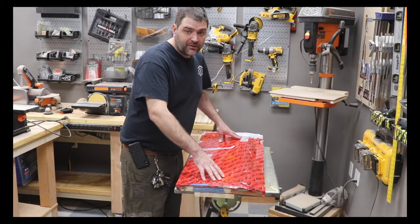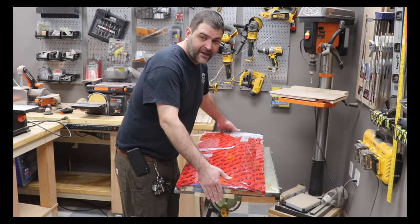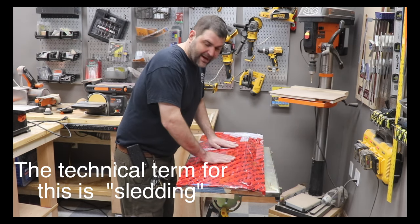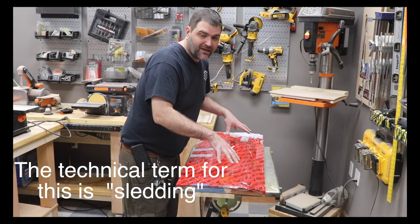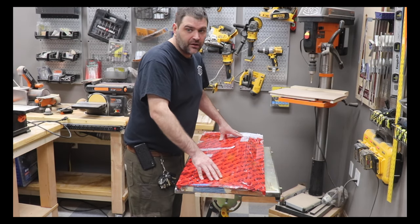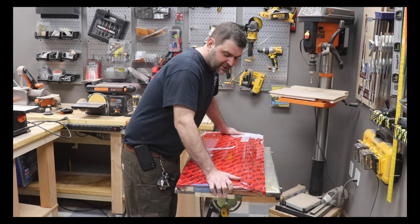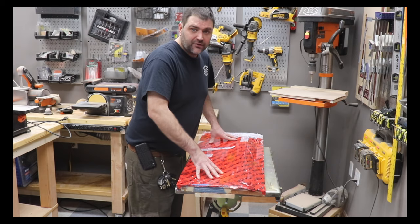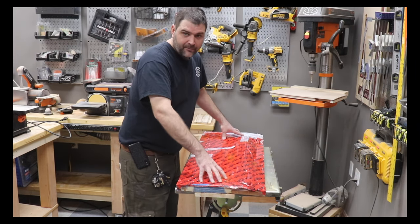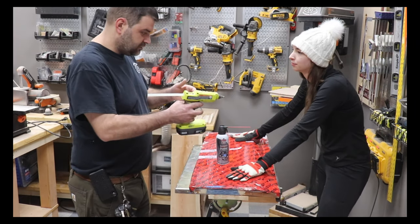It has quite a bit of wobble in it, so we're just going to try to level it a little bit on a sled so that we can pass it through and remove as small an amount of material as possible to get us started. I'm not worrying about the level too much right now. I just want to keep the wobble out of it so that the two plates don't just follow the shape of that misshapen blob. Thank God we had such flat boards.